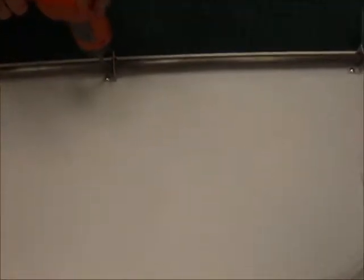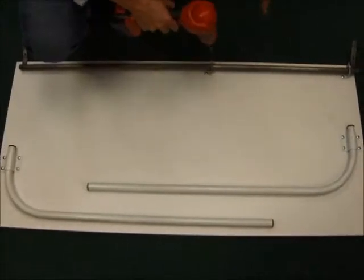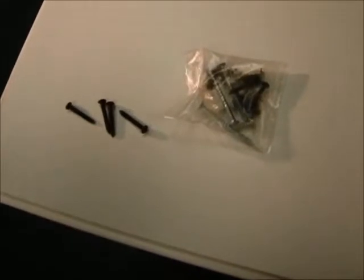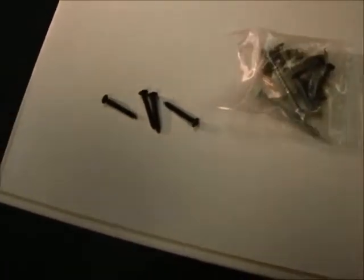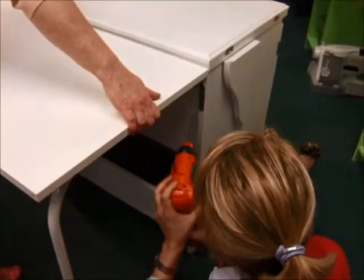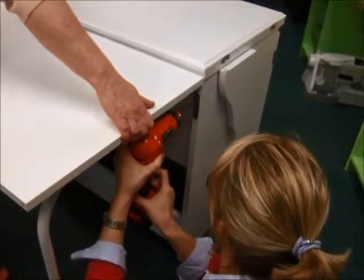Attach the bar to the bottom of quilt panel D using the four screws — note there will be two flanges rather than three. From the hardware bag containing the screws, your last four screws are the black 1½ inch Titus screws. They will be used to attach the quilt leaf extension to the back of the unit. Using two people, screw the black Titus screw through the bracket into the pre-drilled holes on the back side of the Bertha cabinet.